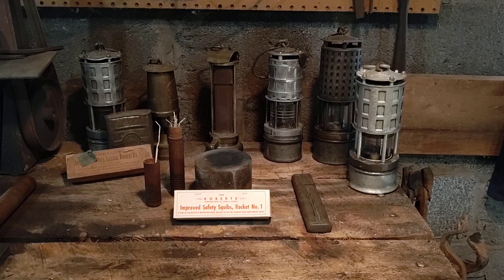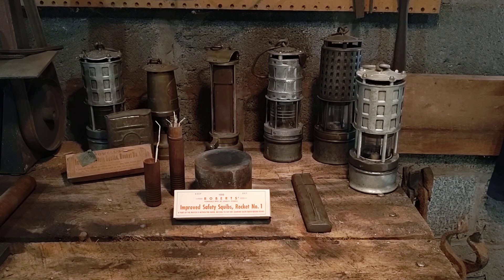Using dynamite or black powder in a coal mine presents a serious problem: many coal mines have methane issues. In the black powder days, mine inspection reports describe how after setting off a shot, the flame and sparks from the black powder would ignite jets of methane gas — methane trapped in the coal would be released in the blast and then ignited. This caused mine fires and burn injuries to miners. Early dynamite also produced a lot of flame and sparks, which could ignite methane seeping from the face, potentially triggering a larger mine explosion with coal dust and methane, or setting the coal seam on fire.